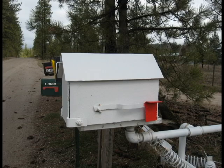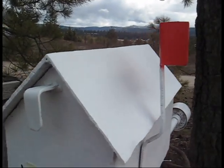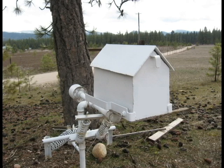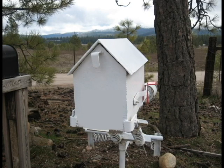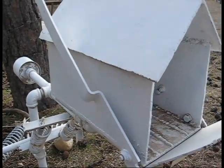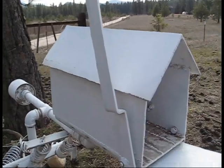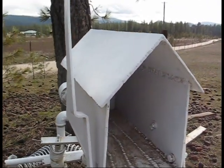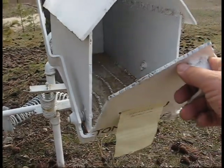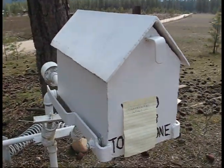What's so special about this mailbox, other than it's made right here on the ranch? Well, when you're a homesteader and you've got to make something do and you don't want to have to fix it a hundred times — everything in this mailbox: the flag, the door, the roof, the whole body, is made out of quarter-inch plate. That gives you a really heavy door, so that makes it hard to open and close, right? Not so fast — right here we have the counterbalance. That piece of flat stock is on there, and he made a little step in it to get away from the eave of the roof. That counterbalances the door, so it's actually quite easy to open and close. Just like that — it works great.